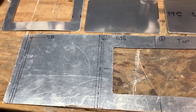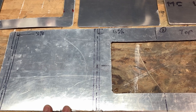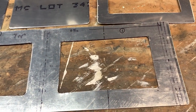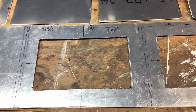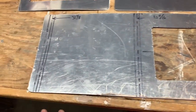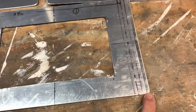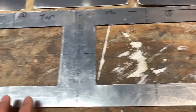So let's see what I've got here. This is the piece that will be mounted to the underside of the wing. I'm going to use a couple of screws to screw it to the ribs, and then the fabric stitching will also hold it on. I still have to bend up the ends — half an inch on this side and half an inch on the other side has to be bent up. And these are the new inspection holes.